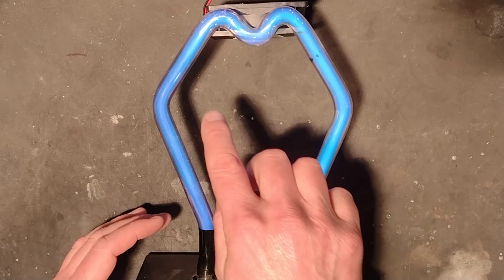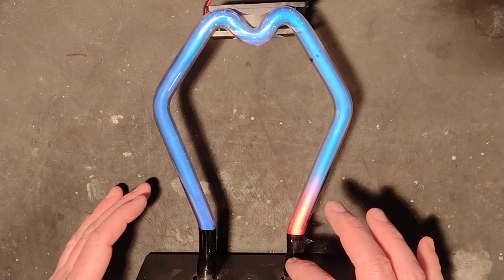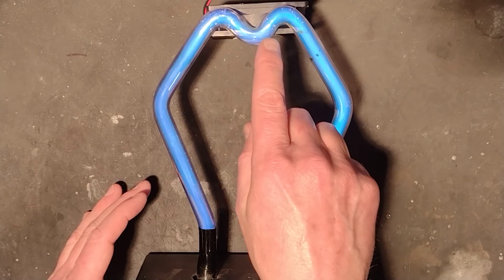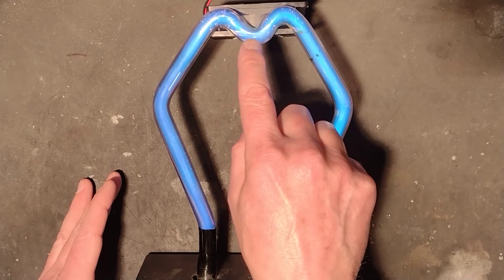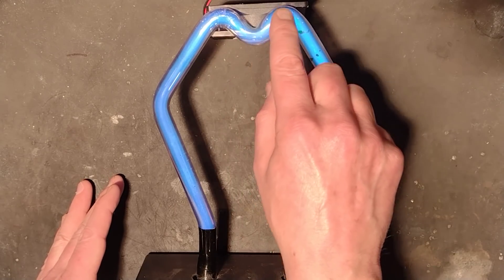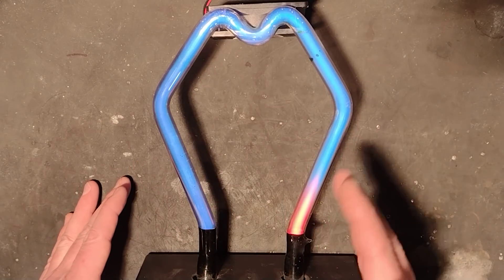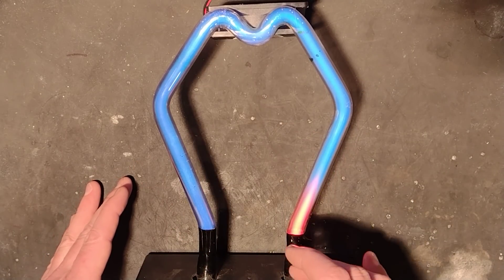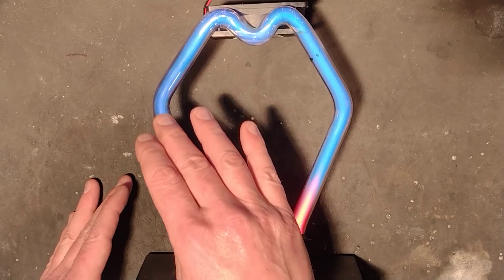What's unusual about this one is that I'm running it on DC, and it's got a neon gas fill with a droplet of mercury. You can see little beads of mercury and a little bit of staining, but it's also got this little dip here. The dip is why I call it the M-tube — it's got that little M-bit at the top — and that is designed to trap the mercury, because when you run a tube on DC, the mercury gradually migrates from the positive electrode over to the negative electrode.